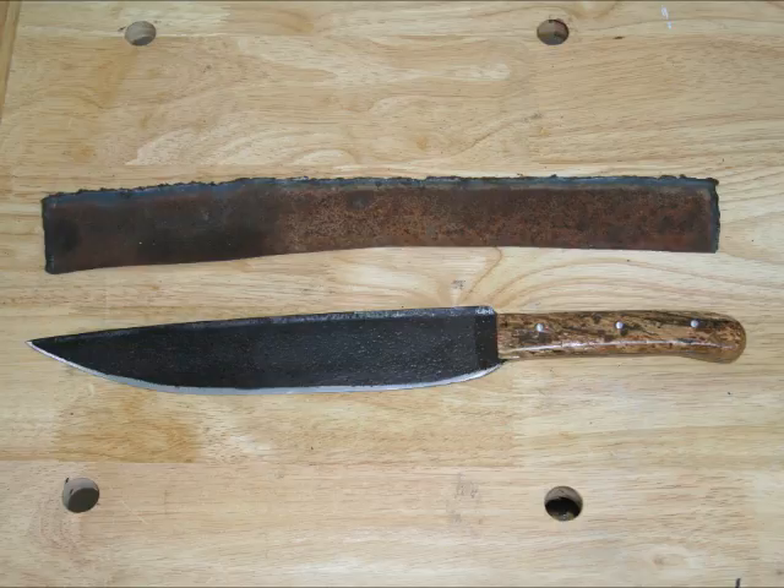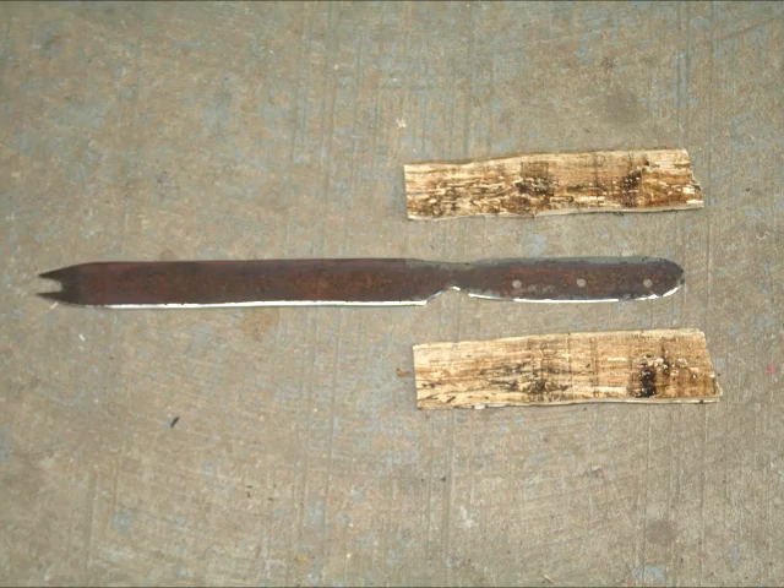We did make a chef's knife from it using a forge, and we were trying to make a bread knife. We tried heating the bread knife in the forge, and that didn't go as successfully as I would have liked. So we have a new tempering oven in the house, and at 1880 degrees Fahrenheit, the shock treatment of the oil bath actually separated the steel from a heavy coating of iron oxide — and this is what you're going to see.